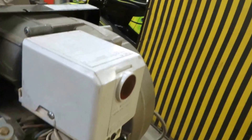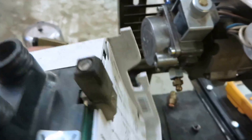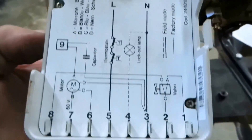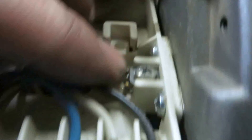On this you're going to pull the control box off. There's a wiring diagram on the bottom of the control box. You can see the little cad cell there on the end. You've got the wiring here — you've got one, two, three. Three is the neutral coming in. Five is the power coming in. Then you've got six, seven, and eight, and nine and ten over here.